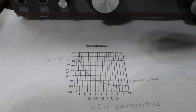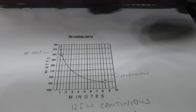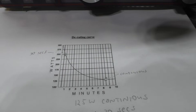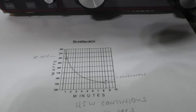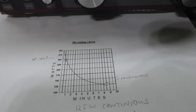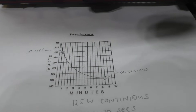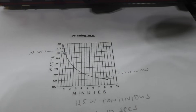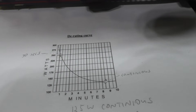There was an article about Don Stoner — he made some marine amplifiers that were supposed to do maybe 50 watts, but his amplifiers only really did 20 watts. How he got around that: when you first keyed the amp down there was a spike — like a 60-70 watt spike you could catch on a scope. He took it to the testers and said 'my amps do 50 watts, watch this spike — bam.' Since he met the specs on that spike, he was able to sell his marine transmitters, even though the boat people didn't like them because they were actually 20-watt units.